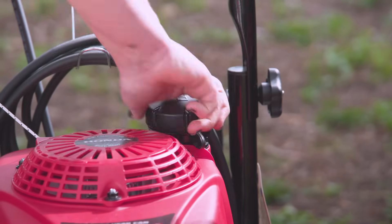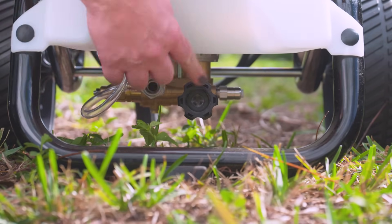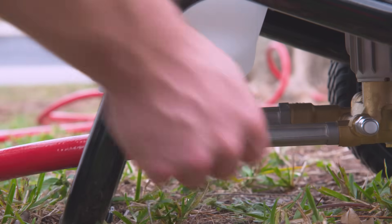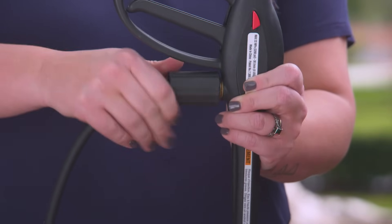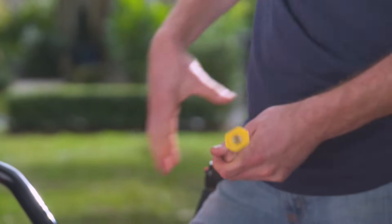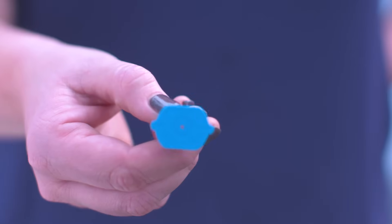With the gas-powered engine, you want to be cautious of a few things. One is you don't want to run out of gas — that can cause vapor lock. And when this runs, it's going to run hot, so you want to allow it to cool down before refueling. On the front of your pressure washer there are two hose nozzles. One is your input hose — your regular garden hose — and the other is the high-powered hose connected to the pressure washer that attaches to the wand. You'll put a tip onto the end of your wand, and each tip has a different purpose, so it's really important to know what each tip does and select the best one that will clean without damaging your surface.